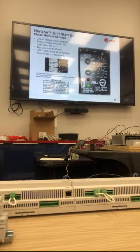But you could adjust the old one though. You could. The problem is adjusting it up. The 2% is there for a reason. It's not because of the compressors or the supply fan or exhaust fan. It's because of the condenser fans. The condenser fans are 3-phase, and they're not built very well. We had a job in Massachusetts where the phase imbalance was around 4 or 5%. It was in Plymouth, so they were pushing 500-something volts to that unit. Huge phase imbalance. We lost 29 condenser motors in about a month.